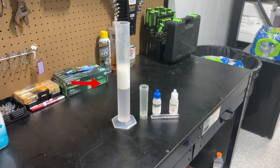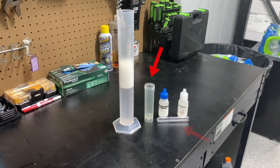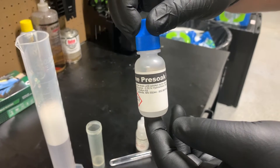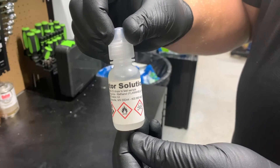To do this you're going to need the following: one graduated cylinder, your titration kit including a test tube, mixing vial, your bottle of either alkaline or acidic pre-soak reagent, your bottle of indicator solution, and your technical data sheet that has your titration chart on it.